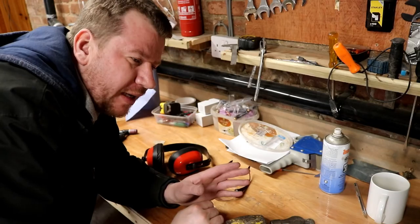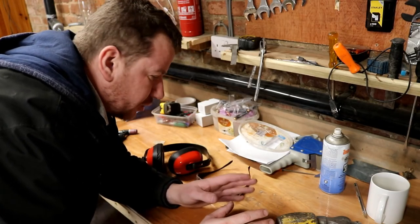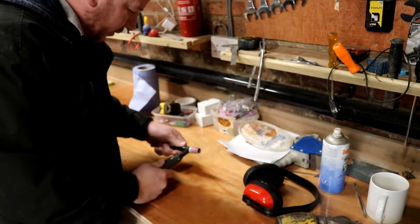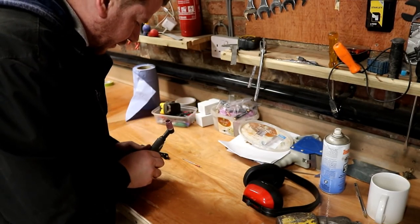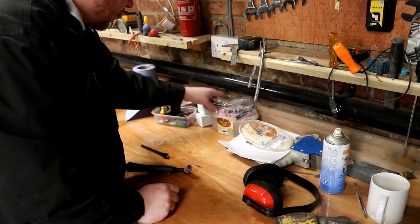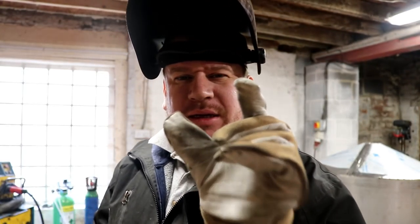Seem to be improving on welding up these cone sections, so I'm going to try something different. Froggy advised me to change out to a bigger tungsten, so I think what I'm going to do is pull this one out and swap it over for a 2.4. Well, I only got like a 1-inch run in, but a bigger tungsten dramatically improved the weld.